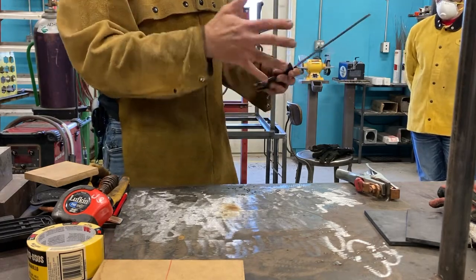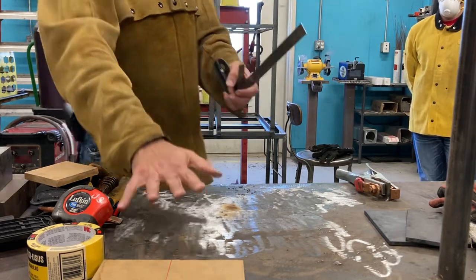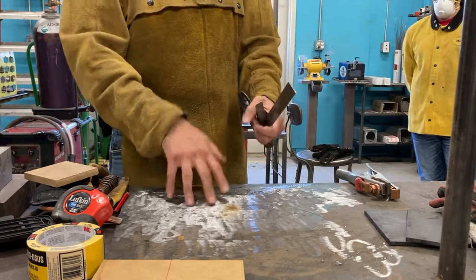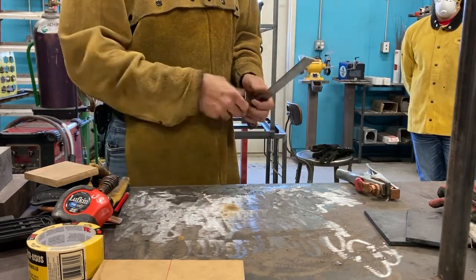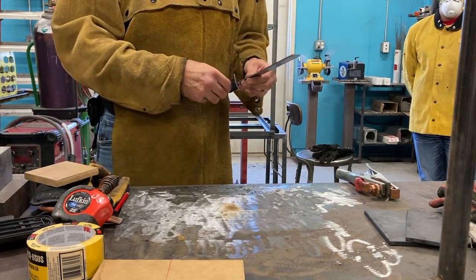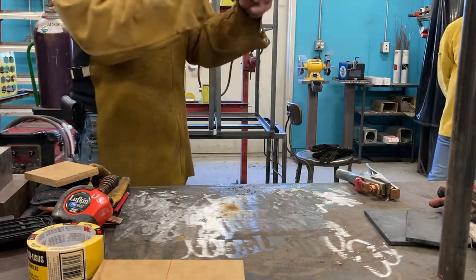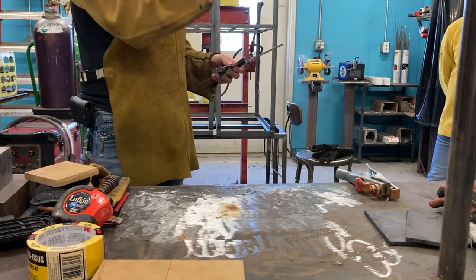So when we're building, how do you know that's flat? Well, I built it on this really nice flat table, so I trust it's flat. So we'll call this our datum surface. So when is the square not trusted, if you were to damage it? Good point. If I drop this, if I was working and it happens, I dropped it on the floor, I'm like, ooh, how do I check it for squareness?